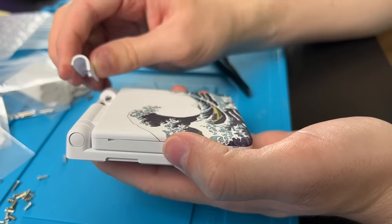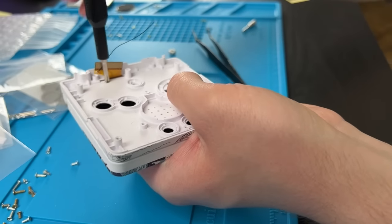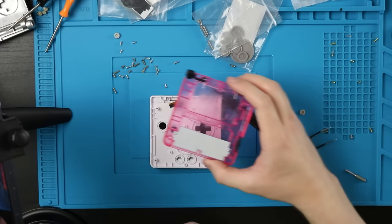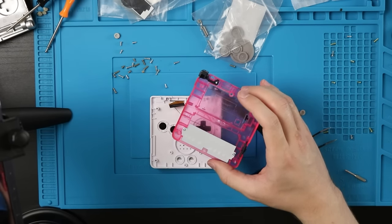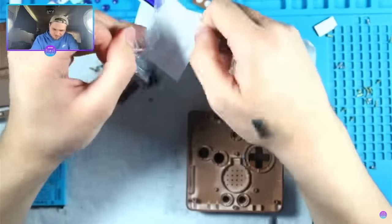Now take this little piece, put it in, and find the longer Phillips screw and screw that really long screw in there. Put pressure with two fingers on this side as you're screwing it in, and don't over-tighten that screw — that point tends to crack a lot in my experience. Now is where I'd open up all the rest of the bags. These stickers are very sticky and they cover up the ziplock part of the bag — I recommend cutting the label or the bag to get in. Not all the volume slider covers come off, so if it doesn't come off super easily, don't keep yanking on it or you'll break it.